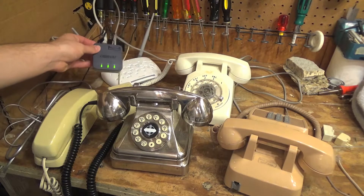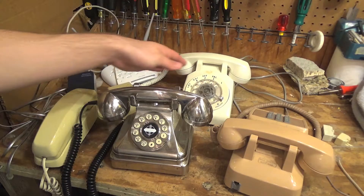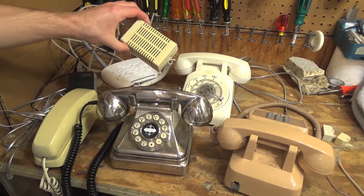I've got the OB Box set up here. A normal phone line usually puts out about 5 REN. One of these telephones is about 1 REN, so in theory 5 of them would be using pretty much all the ringer power. I could not find 5 bell ringer phones offhand, so if we even get to the 5th one, this will be it.